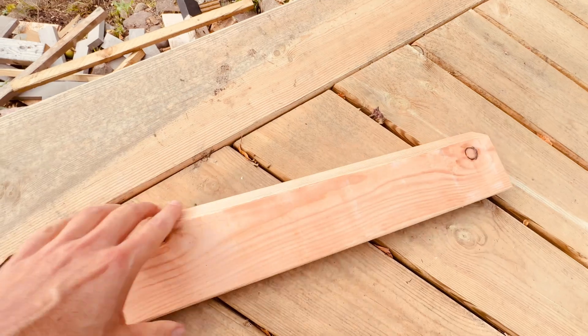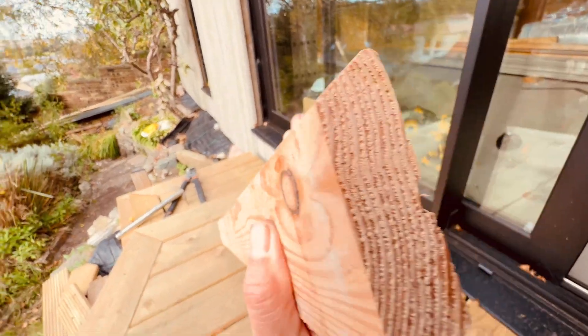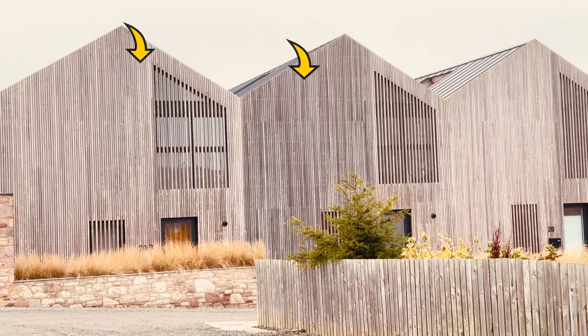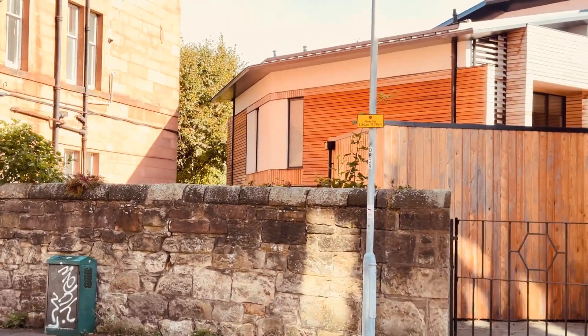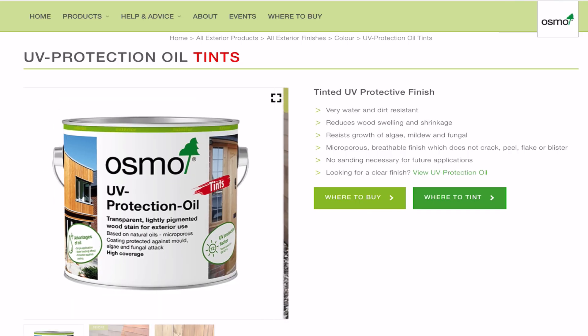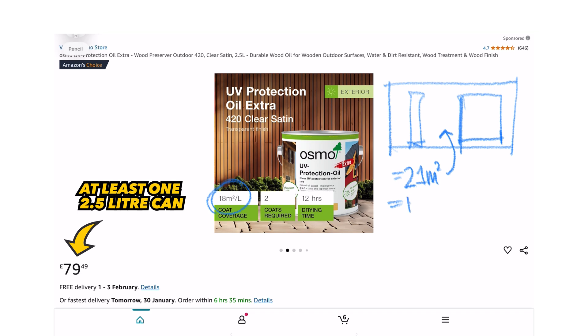If you're interested in timber, today I'm choosing between larch and cedar. I love both — they're truly beautiful — but the minute they're up, if untreated and exposed, they're already deteriorating. That deterioration doesn't affect performance, just the aesthetic. There are two ways the finish deteriorates: first, uneven graying where parts are exposed to more intense UV rays than others, resulting in a dirty-looking elevation. The other is chemical change as resins and saps bleach. Mold can form black staining. There are protective products, but they're expensive and time-consuming to keep applying year after year.